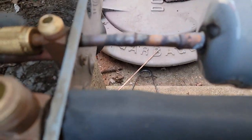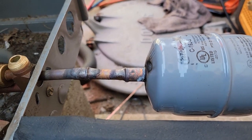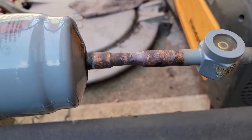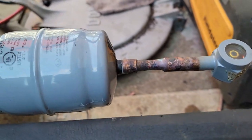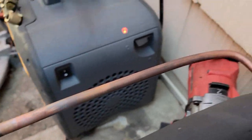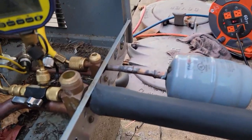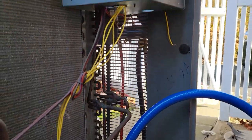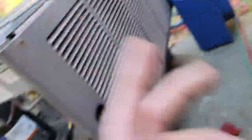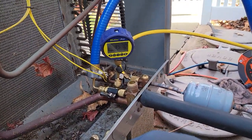These are my brazes, which aren't the best. I think I'm doing a lot better but they're not close to perfect yet. I'm gonna move on to the next unit. I'm gonna do the electrical after I hook up all the line sets, because what's taking the longest is brazing and vacuuming and pressure testing, so I'm gonna get that done before I do any electrical work.